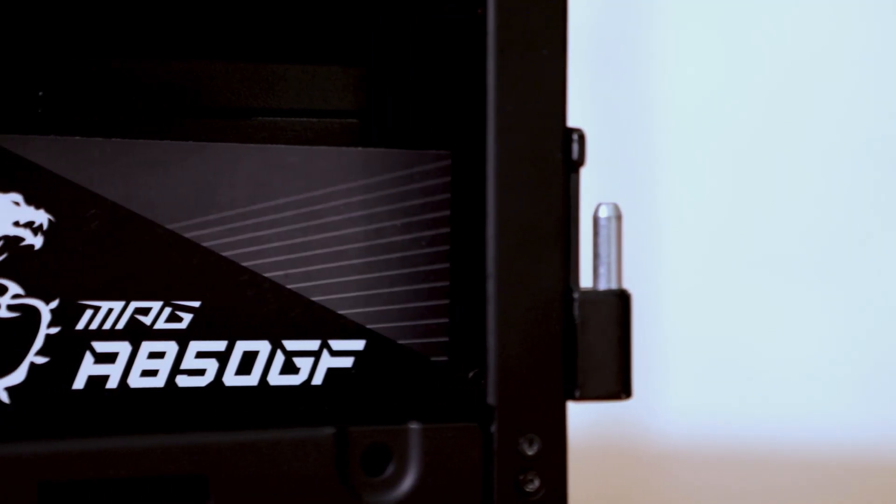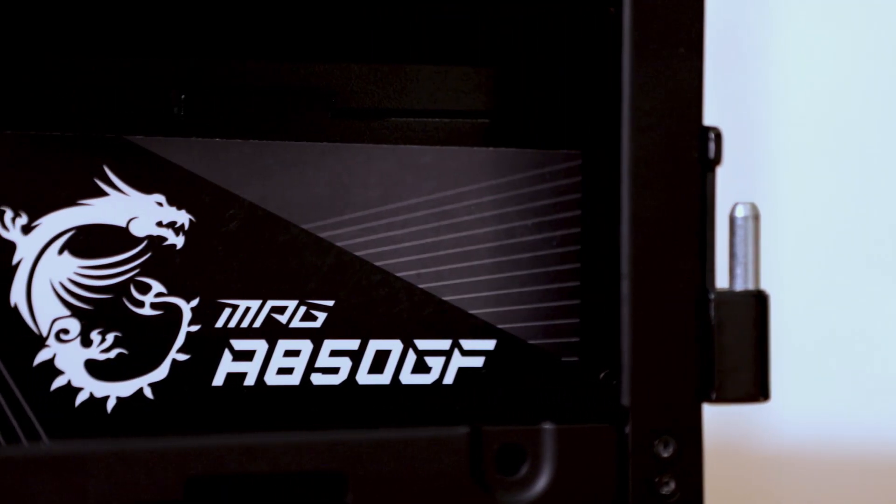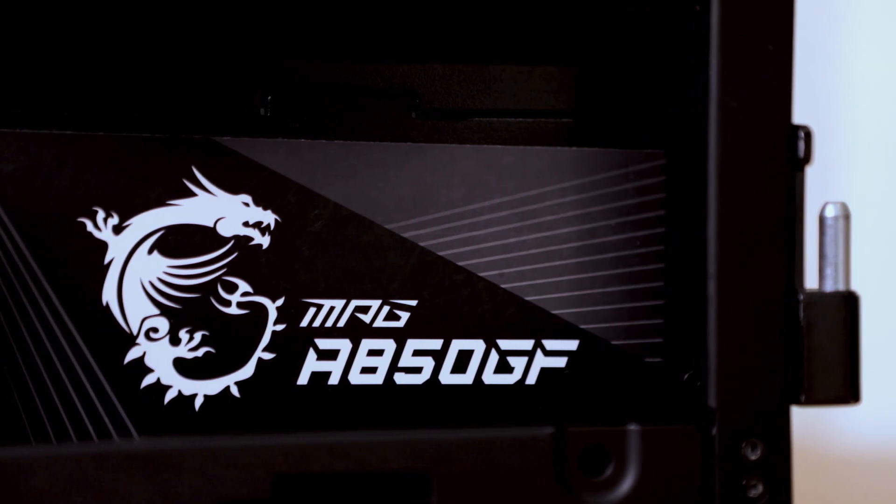Powering our rig is our MPG-A850GF, which has enough headroom and cables for the latest AMD or NVIDIA graphics cards. Overclocking needs a good power supply with solid 12-volt rails, two ATX 8-pin connectors, and we recommend at least a 700- to 800-watt PSU. If you're choosing components, we have an Intro to PC series linked up here for what you need to look for and tips on choosing the latest tech.